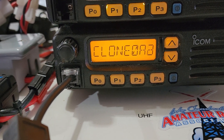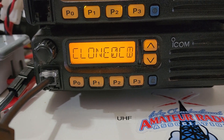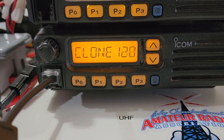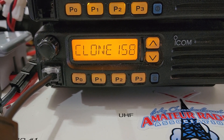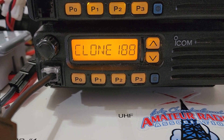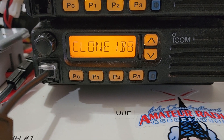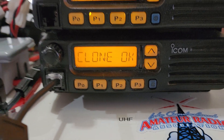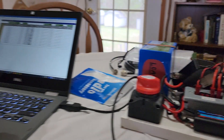This is part of what you get into when working with these radios — especially commercial radios — from a programming standpoint; they may have additional settings you're not used to. We got into the weeds a little on the programming, then sent the new programming over to the UHF radio in the kit that was timing out. The cloning process takes about 35 to 40 seconds. Once complete, it'll beep, and then you turn it off and back on to put it back into use.